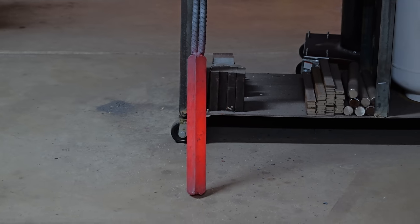Because I already surface ground the billet, there were only a couple faces to clean up on the grinder. The last thing I had to do before the tile weld was ensure that all of these tiles were the exact same height — I did this on the surface grinder, but honestly the best way is to cut them to the same thickness at the start. I'm also cutting some sheets of sacrificial sheet steel, which will be like the bread of the mosaic Damascus sandwich — they'll help ensure no oxygen gets into the billet when I weld it. This is the first time I've ever used a sheet metal cutter. I take the sheet steel pieces to the grinder and clean them off with a dull 80 grit belt so they'll weld themselves to the mosaic.